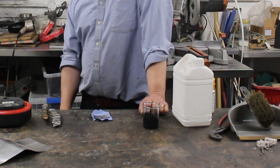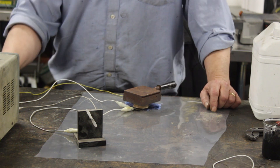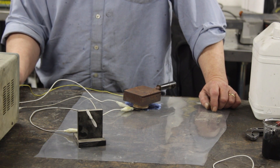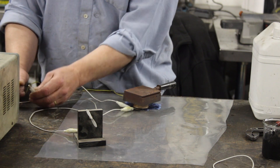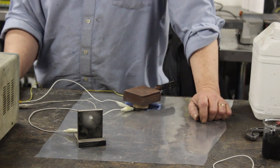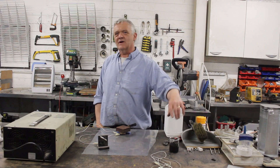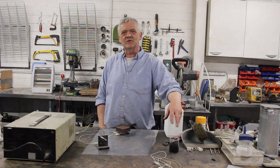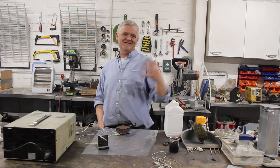Let's give it a bit of charge and see if we can get something out of it. I'm going to charge it at 1.6 volts — charging away. If I disconnect that and connect the battery up to this little motor, we should see that motor spin. I don't intend to do much in the way of proof-up of this because it was taken directly from a research paper. What they reckon is 150 farads per gram, somewhere around there, at a charge voltage of 1.6 volts.